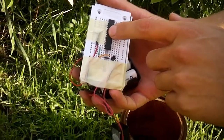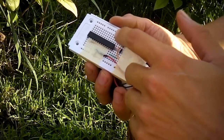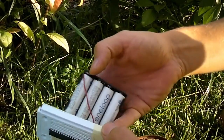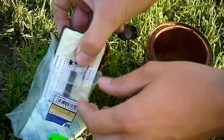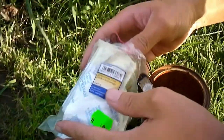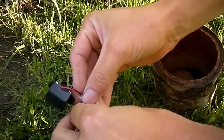This is actually an Arduino, but a very simple one. It only gets the power, and from one pin there is a transistor that drives the buzzer. The software is quite easy — it only turns the buzzer on and off regularly, but in a random way. The tricky part is that the processor must go to sleep in every cycle to get better power consumption.